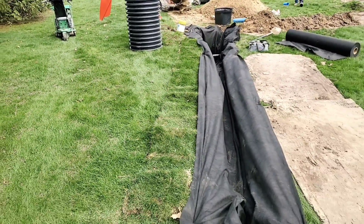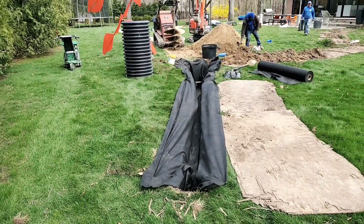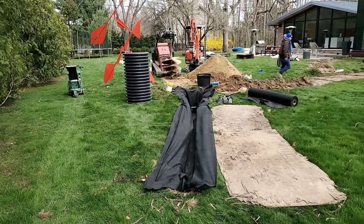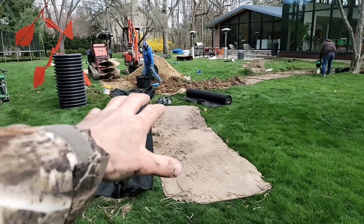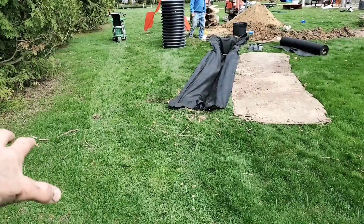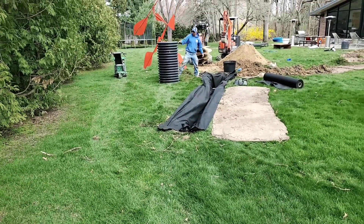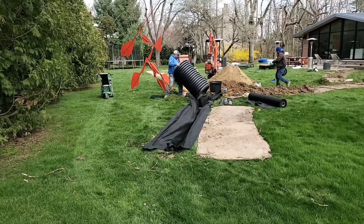I see videos where people say dry wells don't work, and the thing's a hole full of water — but it's put in the low point of the yard. You need to be up where you have a little bit of elevation, get it away from the house. Before you're in the lowest point of the yard, you're in a swale or the far back — go ahead and put that dry well while you still have some elevation.